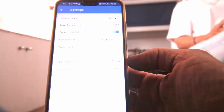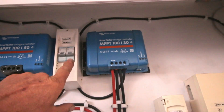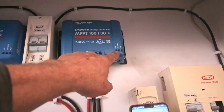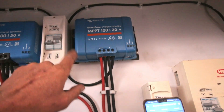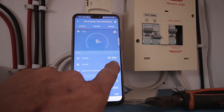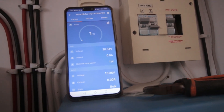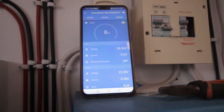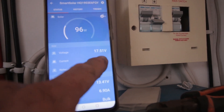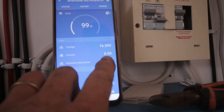We're going to switch it on — charger enabled. Go back to the main screen and then switch on the fuse. You can see it's connected to the battery; there's a blue light blinking. Let's see what happens. It reached 20.54 volts — this is from the solar panel, so there is a voltage. No current yet — I guess it takes some time. There's some current coming: 16, 17, 18 volts. It changes with the sun and clouds, and a few amps from the panels.